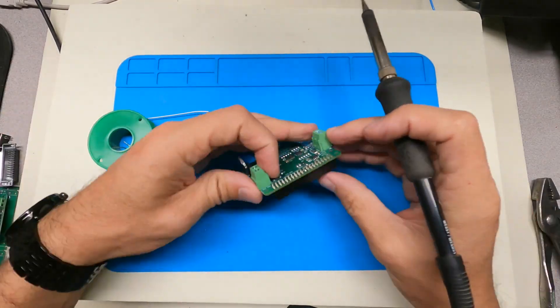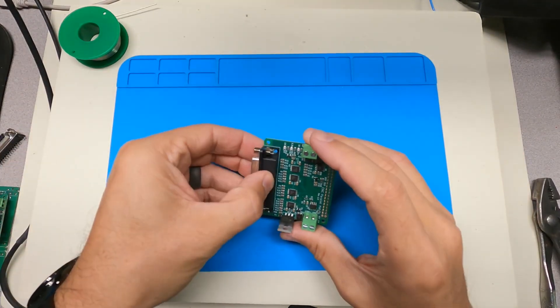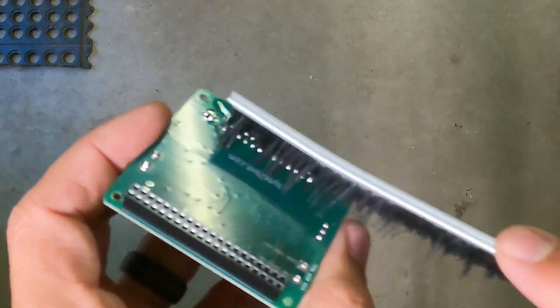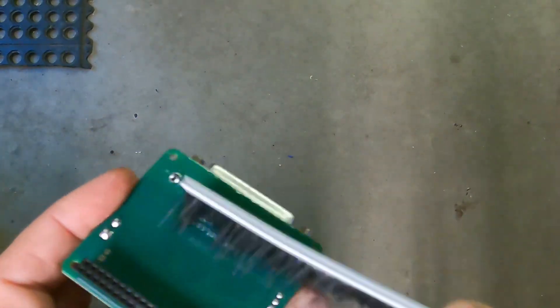This gives me the ability to inspect some of the surface mount assembly and make sure that the connector is installed as straight as possible. After final assembly, the board is cleaned with isopropyl alcohol and is ready for functional testing.